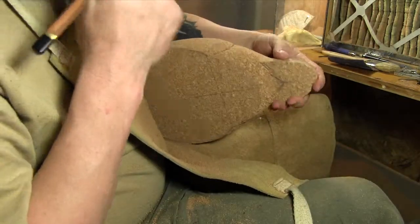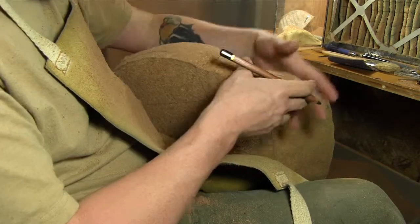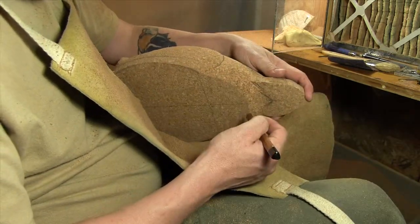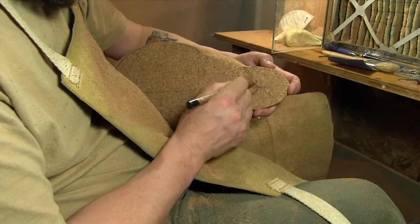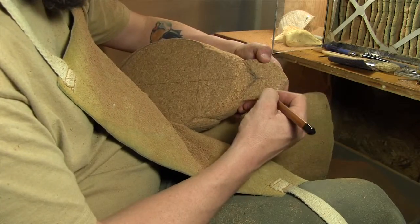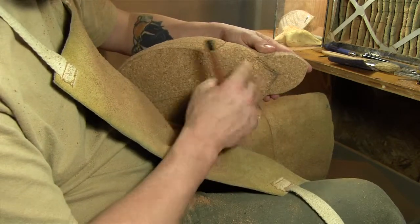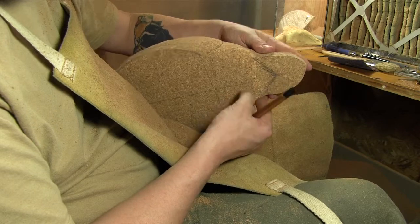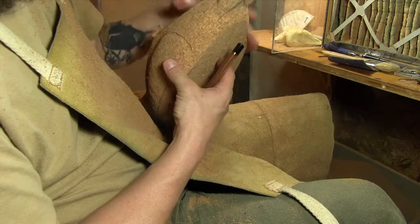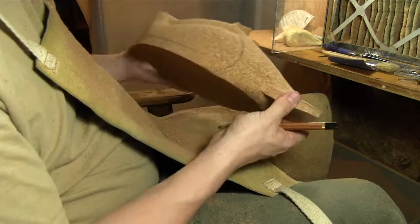Another thing here is, I've elected to use a cork tail on this, and I've been doing that quite a lot lately. It saves a step, saves wood from putting in a cork or wooden tail board, which you glue in. But if it was a wooden tail board, I would have the rump come out underneath here, and I would actually scallop the tail. I would take material from here to there away on the inside to make the tail roughly the same thickness, and that would allow the rump area under here to be finished much nicer than it is. It's kind of flat now. It's hard to tell, but it would be much nicer and smooth, round, like a bird actually is.